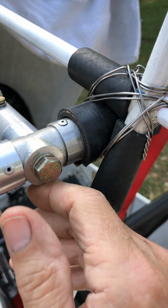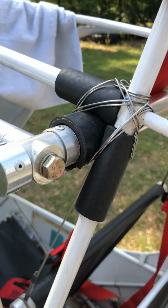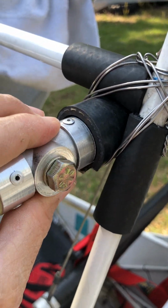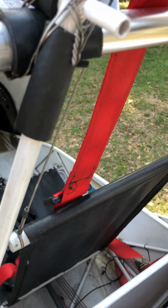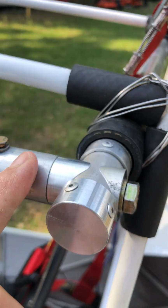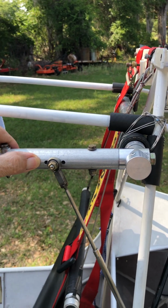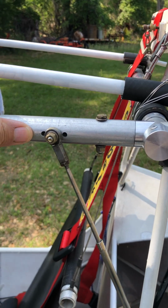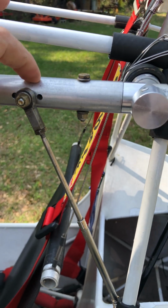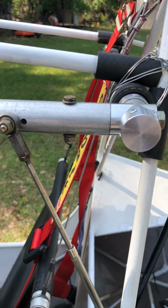And this ring is there just to keep the axle tube in place, in the right position. Okay. And the rest of this solid tube extended all the way out to about where my thumb is, and I drilled it out, or machined it out to about 100 thousandths wall thickness, all the way up to where the thread stops for the 3/8 bolt, to lighten it up.